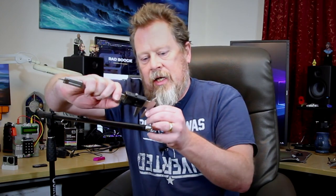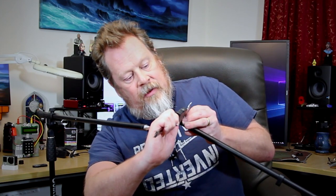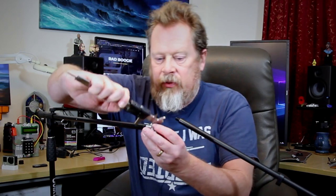To do the measurements, I'm going to use a caliper. I've got a digital caliper - one of my favorite tools, I use it all the time. We'll get this on here and measure this - that's coming in just under 15.5 millimeters. We'll have a look at the other one as well. So 15.4, 15.3, 15.6, 15.5 - measuring in a few different positions. They're both about 15.5 millimeters diameter. So that tells us the size of the hole we're going to need in the clamp.